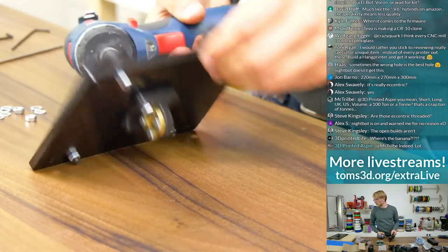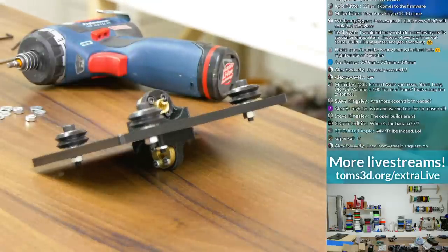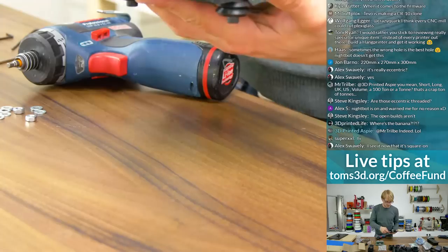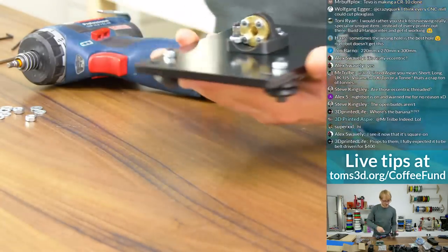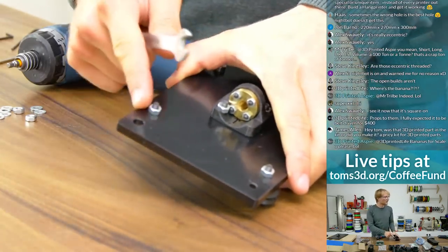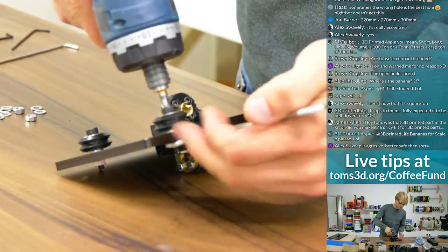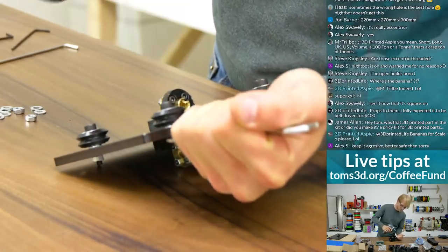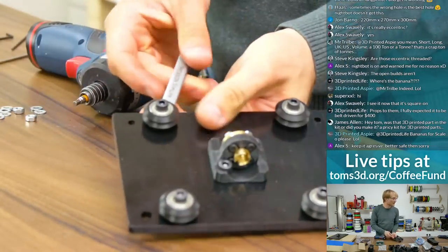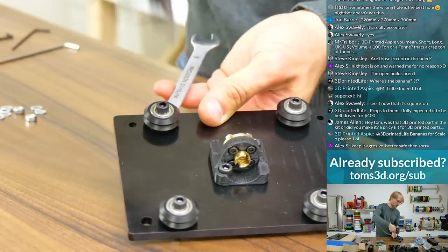So I should really be using a wrench for this. And I do have my wrenches right here. Not all of them, but the ones I need. Which size is that? No, 8. So the ones with the regular nuts, the ones right here, we can tighten up all the way already. There we go. It's 10 newton meters roughly, should be fine. These we can tighten up, these are going to stay down. The other ones, the adjustable ones, need to stay a bit loose, and we adjust these once we drop them onto the rail.